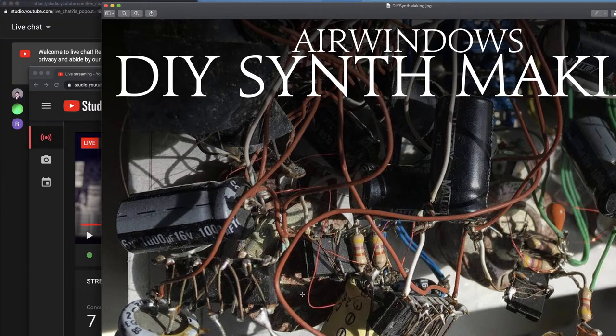So once you've powered these, and some of the capacitors are for providing power to the chip, ground is on one corner, voltage goes to another corner, and then what we've got is these resistors and things soldered onto here. These are wired up in various peculiar ways to produce what I believe in this case was an equalizer. And it was an equalizer based on these hex inverters. So it was an equalizer where the electronics in there were field effect transistors.